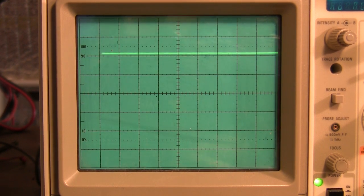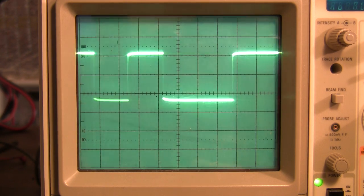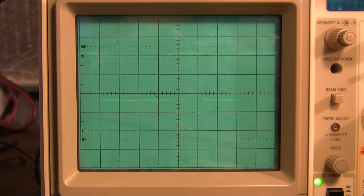Now, since we're working with Manchester encoding, there are some things to remember about how it's transmitted and how you read it. Now I can send a remote signal in. This is the number one on the keypad here, and it just looks like a square wave, an irregular series of square wave pulses coming in until you get to the end.